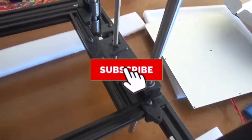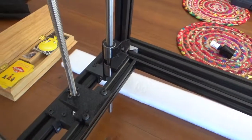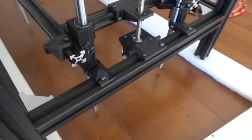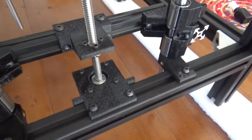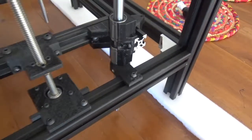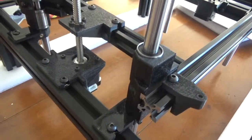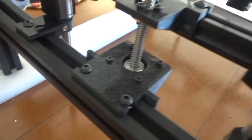As you can see, all the z-axis bits and pieces are together as well as the frame for the build plate. It all went together fairly straightforward, a little bit fiddly at times getting all the shafts and everything lined up and square, but it's looking pretty good. One thing I didn't actually do was trim the z-axis shafts, and I'm glad I didn't because I was planning to put the electronics underneath, but I've changed my mind. I'm going to lower the bottom frame down so that I get an extra 100mm of build height.